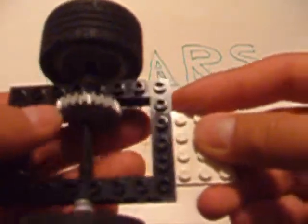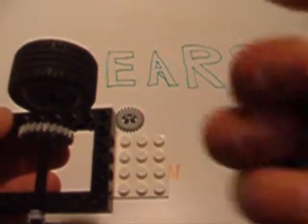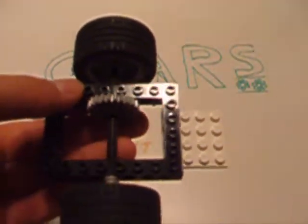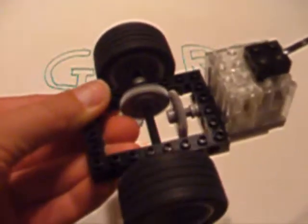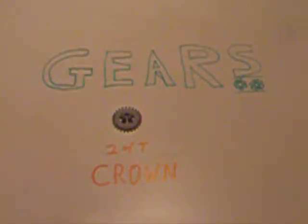Let me give you a couple examples. Take a look at this car chassis here. If you just had straight-tooth gears and wanted to motorize this, it would be very hard to place the motor somewhere very close to the wheel. And if you wanted to have the motor farther up in the model, you'd have a very long gear train. But if you were simply to place a crown gear here, you'd be able to attach an axle as far back as you like, attach it to the motor, which makes it very easy to motorize this simple little model. Rotating the same frame 90 degrees gives you a simple frame for a helicopter.